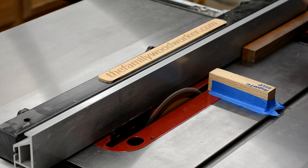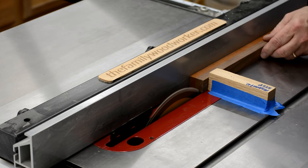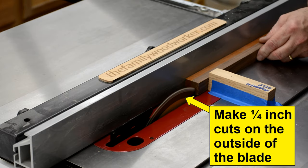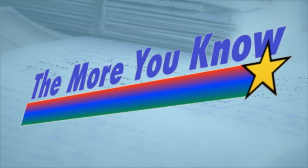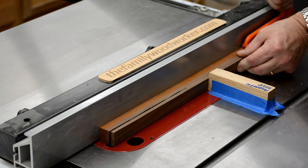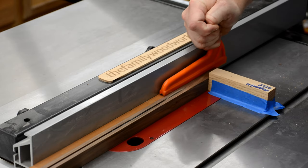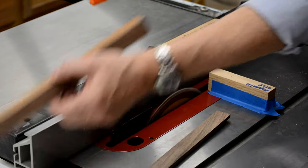I'm also going to make two sets of cuts on the table saw. The first cuts will be set at a quarter inch, and you never want to take that small of a cut on the inside of your rip fence — you're just asking for a nasty injury, so keep it safe. I'll set up a stop block on the outside of the blade so I can hold the stock against the fence. I'll need to adjust the rip fence each time for the wood to lightly touch the stop block, and then all cuts are going to be a quarter inch thick.